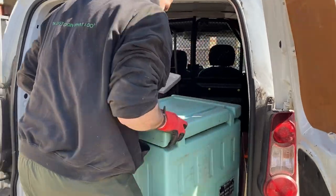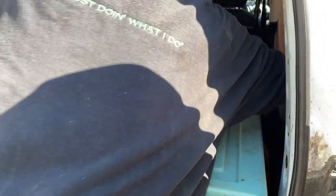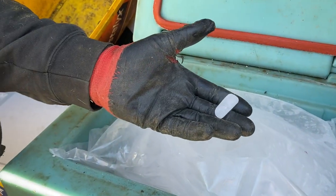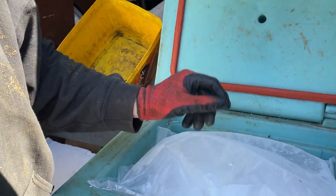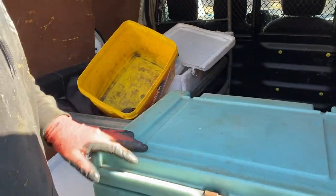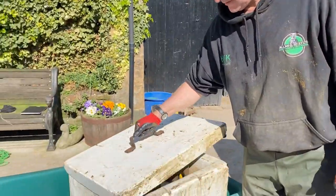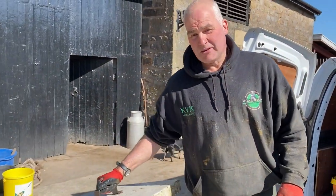We're just going to show you what he puts in his box, where the irons sit. So in this one we've got dry ice. This is compressed carbon dioxide — it comes in pellet form from the factory at minus 79 degrees. Then we add that — keep it in a cool box, an insulation box. We mix it with the irons and then we add industrial alcohol, which is called isopropanol. That lowers the temperature a bit and sends the irons to about minus 35 degrees.